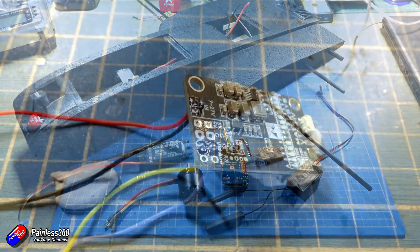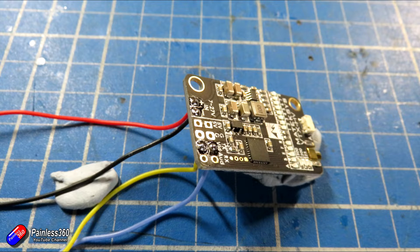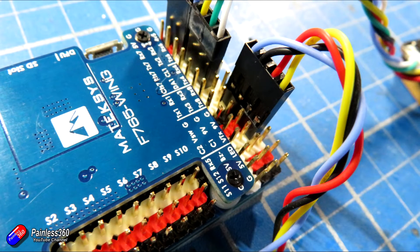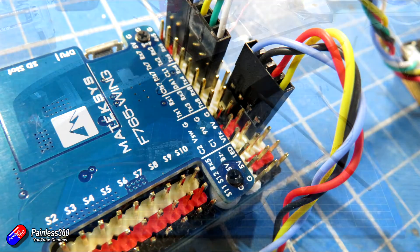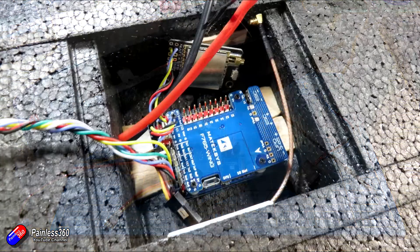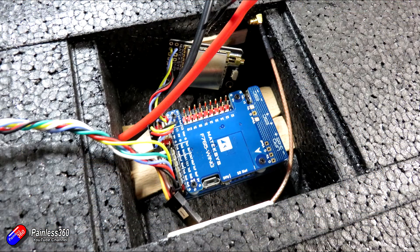The video transmitter: I've done exactly the same things as every other time — soldered and crimped on the connectors and pushed it home into the pins as described in the Matek manual. We are going to have to configure that up. The other thing is the receiver — I'm probably going to decase it to give me a little bit more room. It would have been great if the E-Wings guys had given me just another two or three centimetres in the electronics bay. If you're fitting just a receiver and maybe a simple stabiliser there's tons of room, but fitting all the electronics neatly and internally is a little bit tight — though definitely doable if you put the ESC outside.